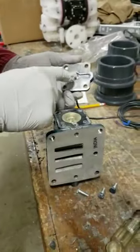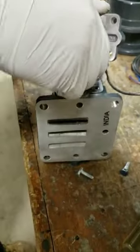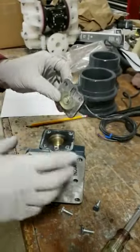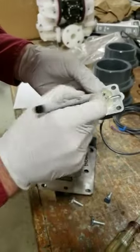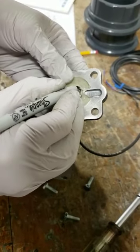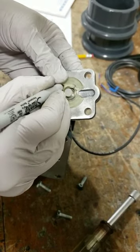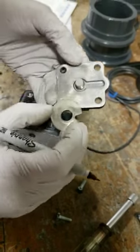As you notice, the slot lines up in this pump with the bumper like this into that. That's an air hole. Occasionally by introducing a prox, it uses up some of this room in here for this to breathe. So what I like to do is just trace on here a little bit to give you an idea. I'm going to port this pump open so that it's able to move air through here a little better — basically around the prox into the area and out this.